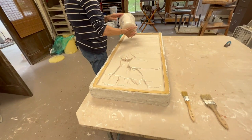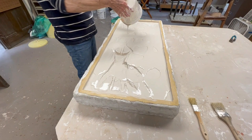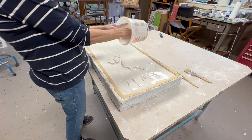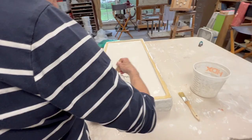For each coat we're mixing 36 ounces of powder and 12 ounces of water — by volume, not by weight — for a total of 48 ounces. Same procedure as the first coat, but it will set a little quicker. We mixed it right at 9 a.m., so we'll see how long it takes.